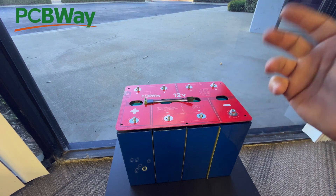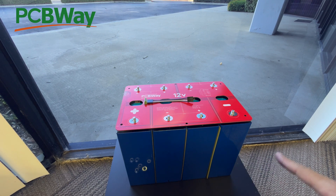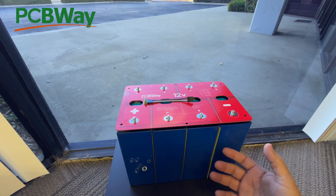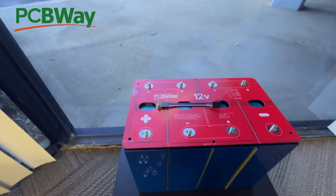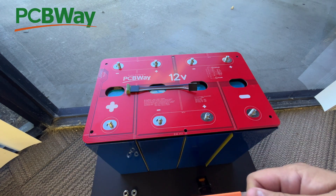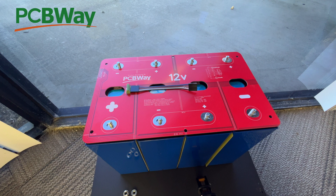But these batteries are large — up to 330 amp-hours — and they're 1C batteries, so even though they're not really power batteries, 300 amps is still 300 amps. You could push these at 1C, loading them at 300 amps. If your load can reach those levels, this PCB alone won't be able to do the whole job. That's why you might want to use the included bus bars too. There are markings showing where they go — if you put them in the wrong spot, you'll make sparks and ruin things. That's what first-timers have trouble conceptualizing, but with this board you don't have to worry.